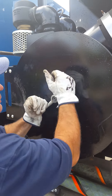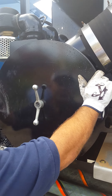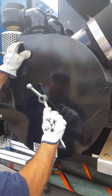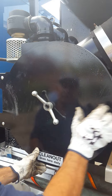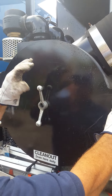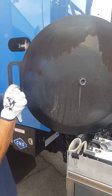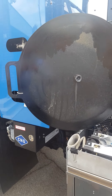The first thing you do is loosen up the strong back. The strong back just holds the front plate against the rubber gasket to create the seal. So you unscrew it, and as you can see it's coming away from the internal draw bar. Once this is unscrewed it'll pivot to the side. What I like to do is use a bungee cord to hold the door back while you're working on it.